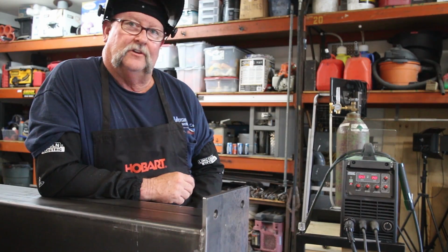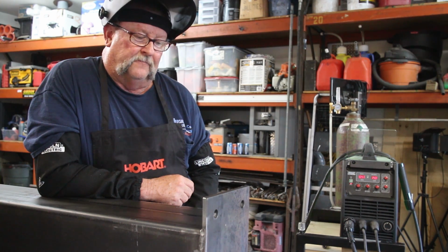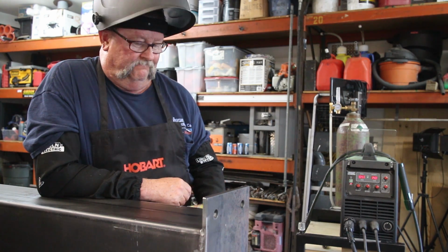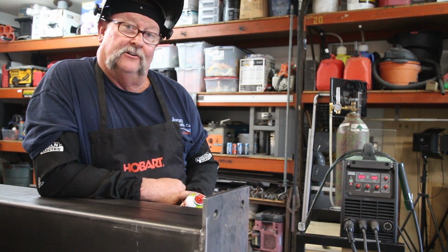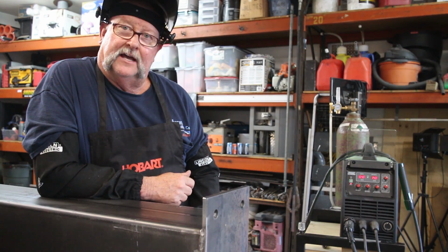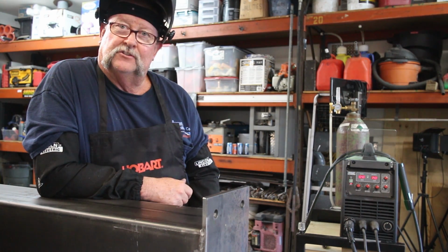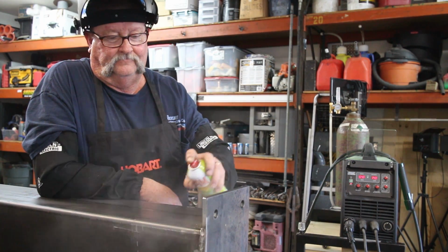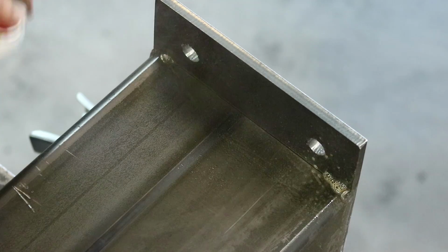Okay, I got a little trick for you guys. Something I learned from a fellow YouTuber, Jody Collier over at weldingtricksandtips.com. PAM for splatter. I've personally never used it, but I'm noticing I'm getting quite a bit of splatter here. Probably running into high amps on this thing. So I'm gonna give it a try, and we'll see how it works.